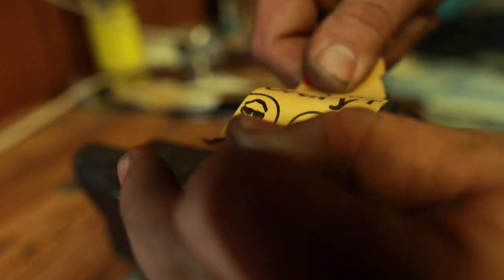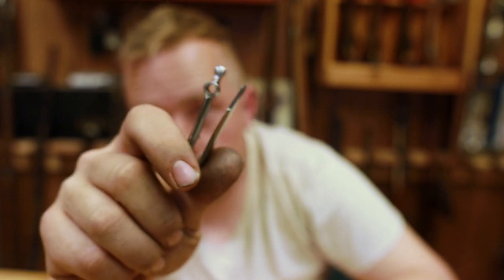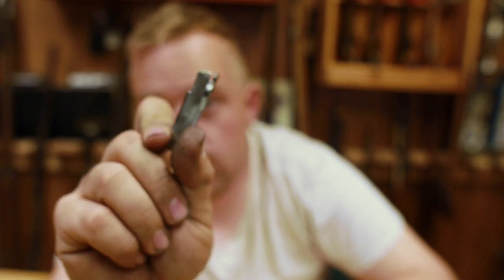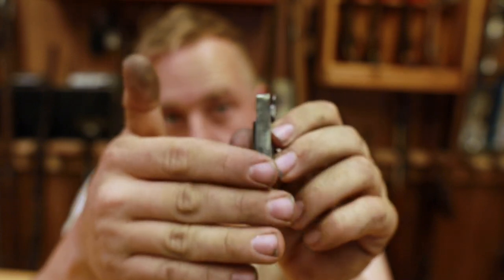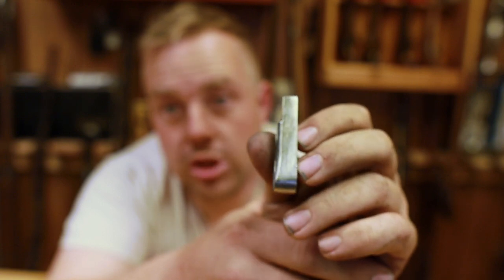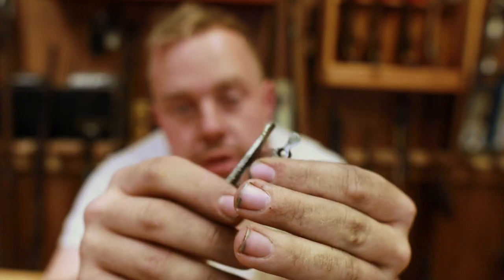You can use emery cloth — that would probably be a really good idea for this. Now I'm ready to start the polishing process. We've got her polished up pretty good; it's kind of hard to get to the inside but I'm not too concerned about that. I just wanted to make sure I got a very nice, almost mirror polish on this thing. I would strongly suggest you go with the length of the spring — don't try to go across — because going across creates a tension point where you can actually snap the spring. Go lengthways, not crossways, kind of like with the frizzen.